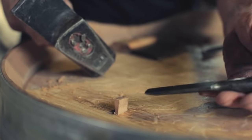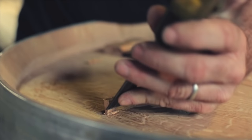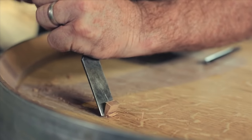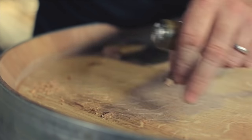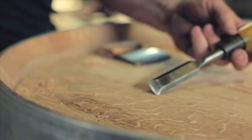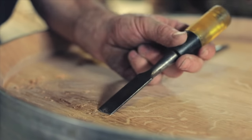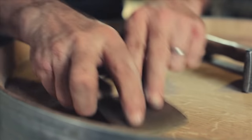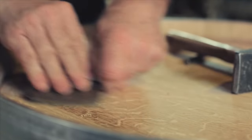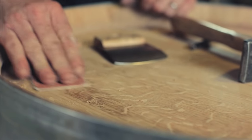I'm going to trim off the excess wood with the chisel here, cutting from both sides, so that I've left the middle part of the wedge in there. Now I'll tidy it and trim off the excess wood. With the scraper I'll scrape it. And as always, anywhere you scrape wood you open the pores, so now we'll close the pores with sandpaper.